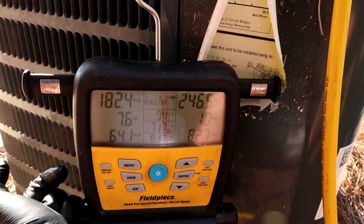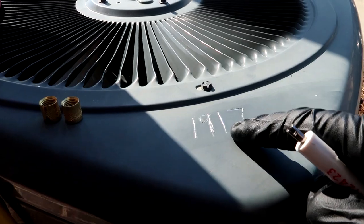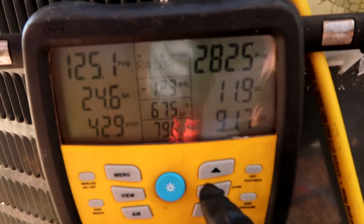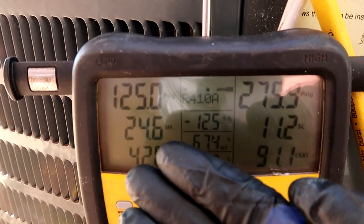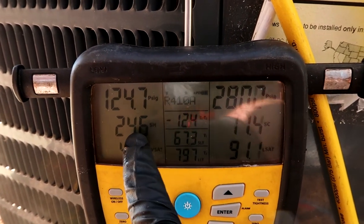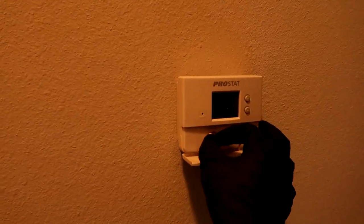All right, let me get this to 12 degrees subcool. I like to use a little screwdriver to engrave these units with a label — it won't wash off like a marker and it'll rust and never go away. All right, nicely labeled. I've got it at 12 degrees subcool. It is a rotary compressor, so you can't get them below 20 degrees on the superheat as I've mentioned in previous videos, but up at the coil it should be around 19 degrees. I just deal with it — I didn't build the place. Now let's go look for the leak.